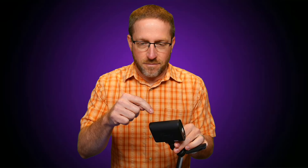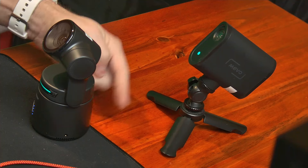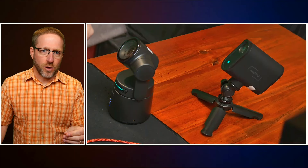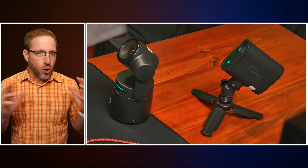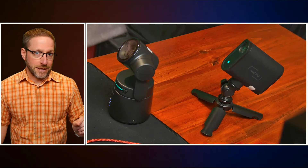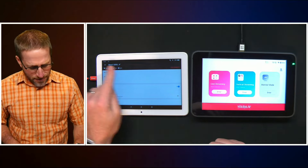That tiny little box includes the battery, microphones on top, camera in front, tally, and all the networking — it's all included. Both of these devices also have the ability to be tethered. You can use the USB-C out on either of them with USB-C adapters to put them on a wired network, which can be critical in situations where there's a lot of RF interference on Wi-Fi. Putting them on a wire gives you the same capability but with more reliability.